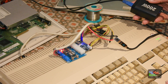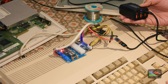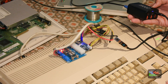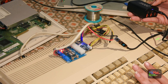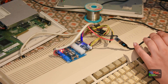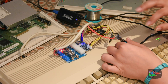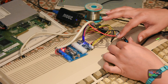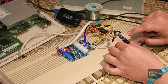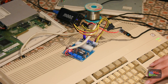I'm using a generic laptop USB-C power supply. I think as long as it can provide 12 volts it's fine. There are different voltages involved with USB-C and different adapters accept different ones — maybe fast-charging adapters work too. And it's not heating at all. I thought this was going to be a boost converter and get really hot, needing a heat sink, but that's not the case. It's working absolutely beautifully, so I'm excited.